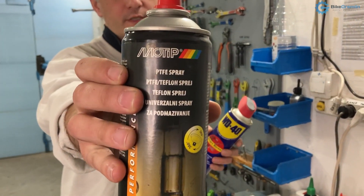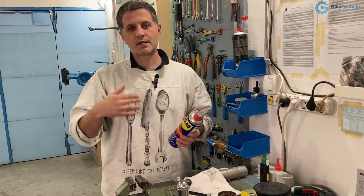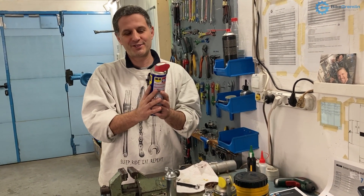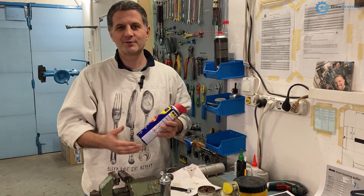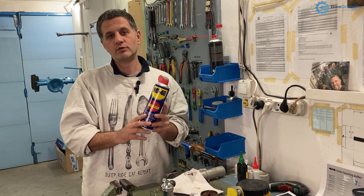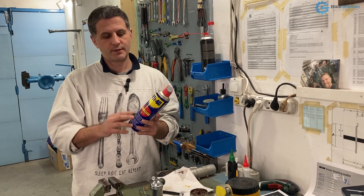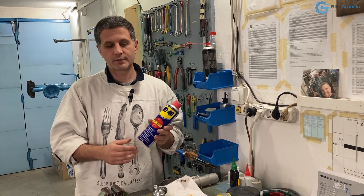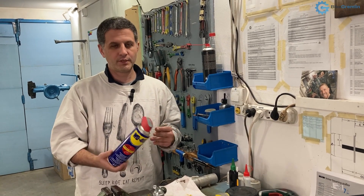There are better degreasers, cleaners, and rust removers available, so WD-40 is good to have in a pinch. It's good for lubricating locks so they don't freeze in winter, but for other uses I prefer to use separate, dedicated products. WD-40 is generally not a very good lubricant in itself — it has a very small amount of lubricant inside it. That's a common mistake. It's a brilliant thing to have, and I use it a lot, but not as a lubricant whenever I can use a proper lubricant. It's just a good thing to have in your toolbox.